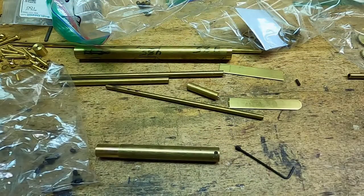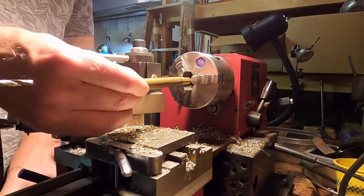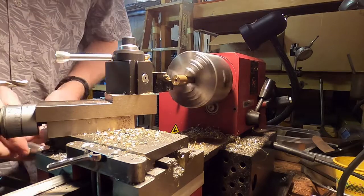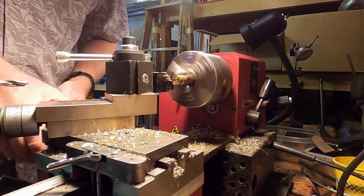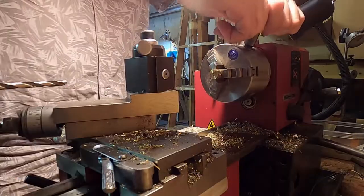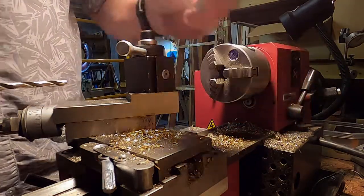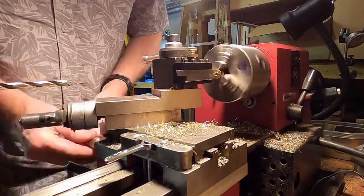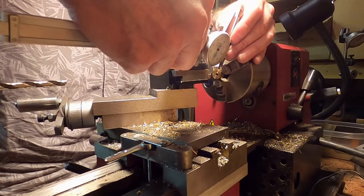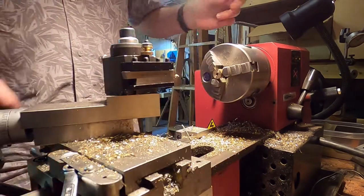So now we need to make this a quarter inch on the lathe for this cut. There is our hub so far. Now you see there's a little piece on here yet. None of this has to be machined exactly because I need a little bit of play in the gear when I mount it. A quarter inch, and that's good.